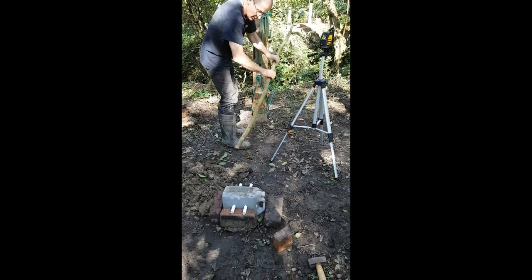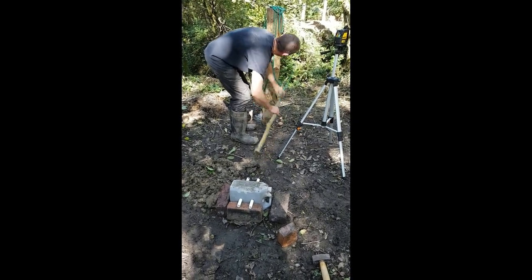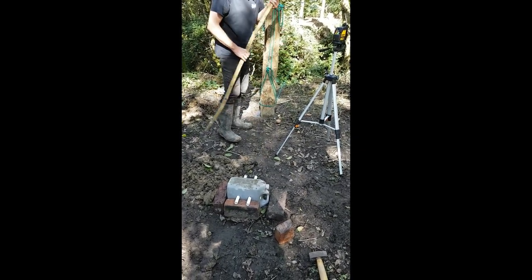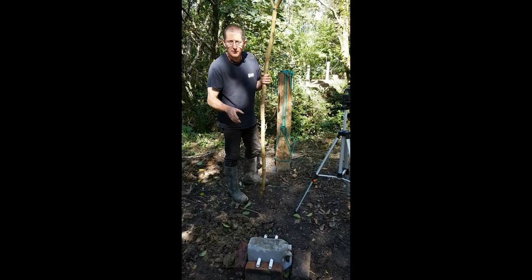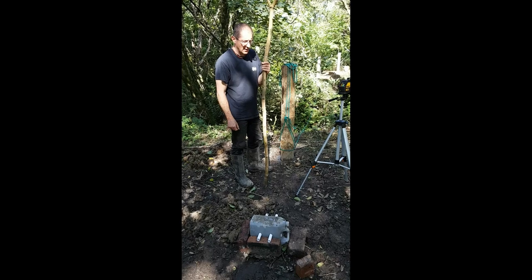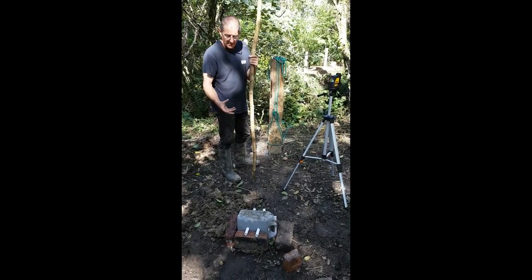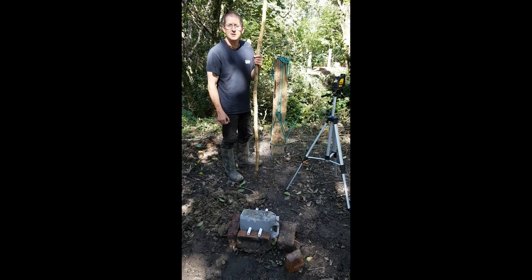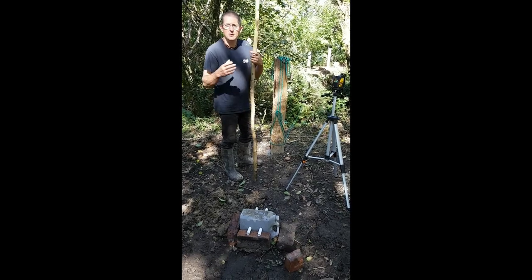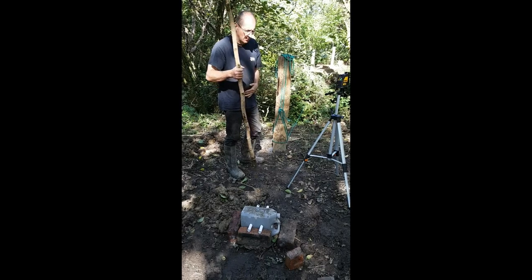And the inner one is the main deck wire travelling across to the other side. So that's a metre of concrete into the ground. So we're fairly sure that's a pretty substantial anchor. And all the plastic container is doing is allowing us a flat surface, and a transition from the round hole that we dug into a flat surface where the thread bar can bolt to.